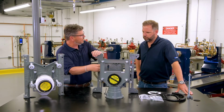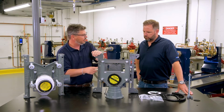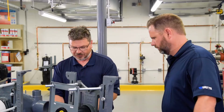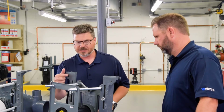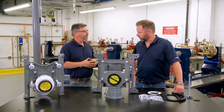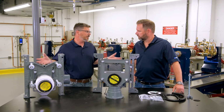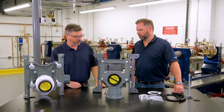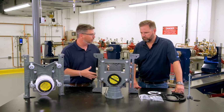In keeping with that mass assembly or prefab style, we added some more features. Not only the front-facing adjustment on our legs, we have our standard incremental adjustment measuring lines that we have on our standard ISCA, so you know your heights. But we added a few different options as far as where you can mount the legs to the carrier. Then we put threaded bosses throughout the carrier, because we all know people like to use angle iron to fasten the different carriers together, whether it's a battery of 6 or a battery of 8 toilets. So we put threaded bosses at different places on the feet so that you're able to do that.